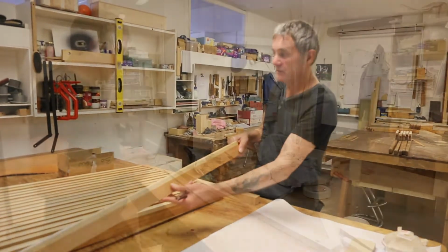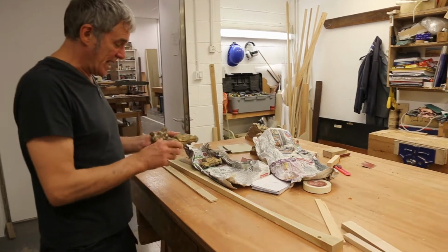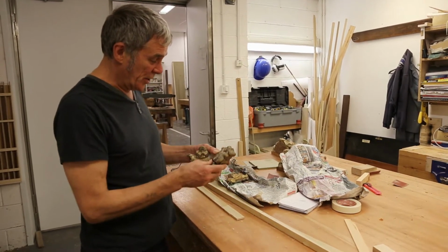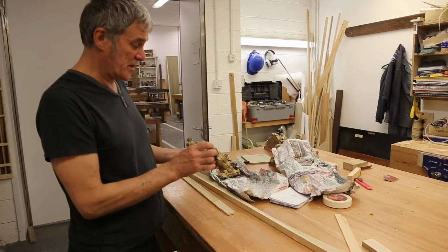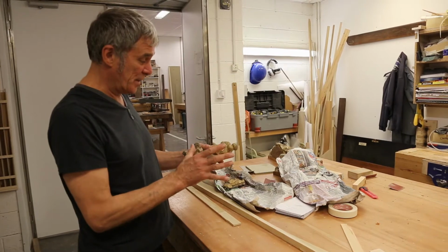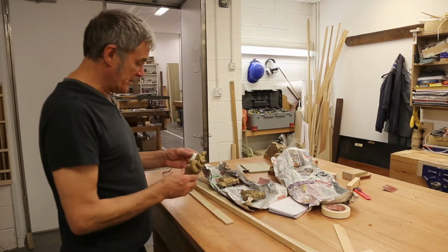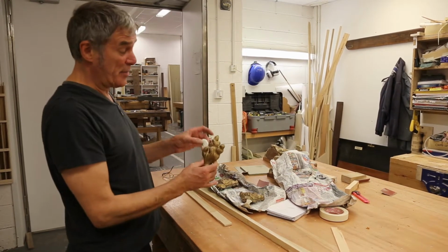These are the three finials from the top of the organ case from the towers, and these are a wooden core with plasterwork applied, and then they've been put on with iron nails, and over the years the iron nails have rusted and exploded. So bits have fallen off, and you know, these are 40 feet up in the air, but we've remodeled this one using car body filler.